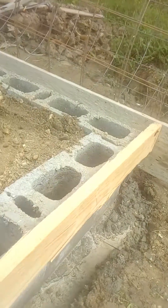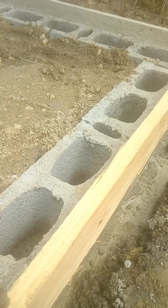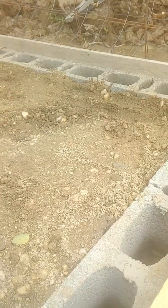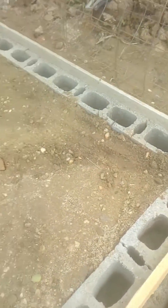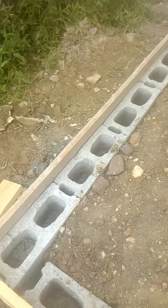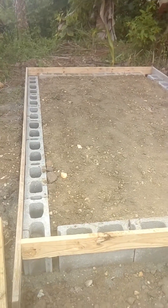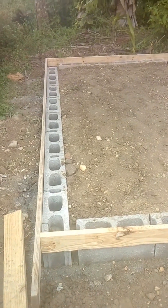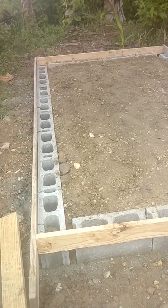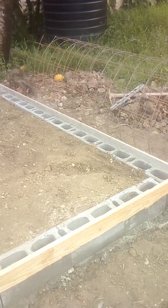We have the forming around here, which I used four-inch, four-by-one-by-ten lats — pine pitch pine lats — and that's how it looks. I'm hoping to complete that within the next hour or so. We're going to pour concrete and it has to be square, everything lined up perfectly. I'm just going to roll all that wire, put it on the floor, and then we're going to pour concrete.